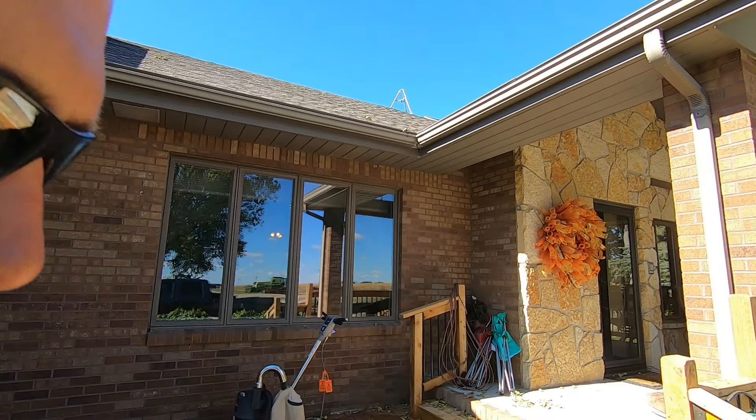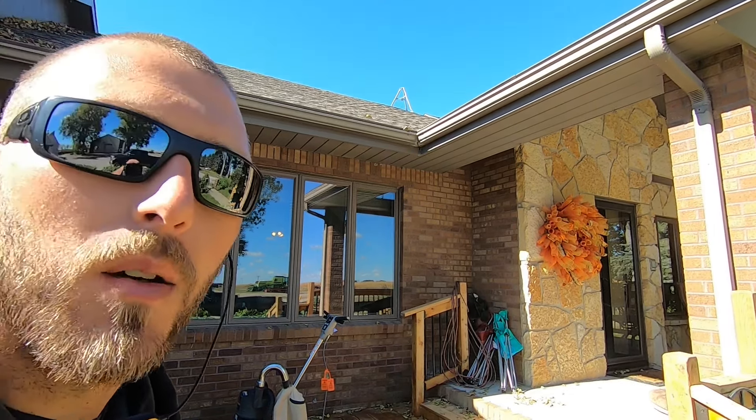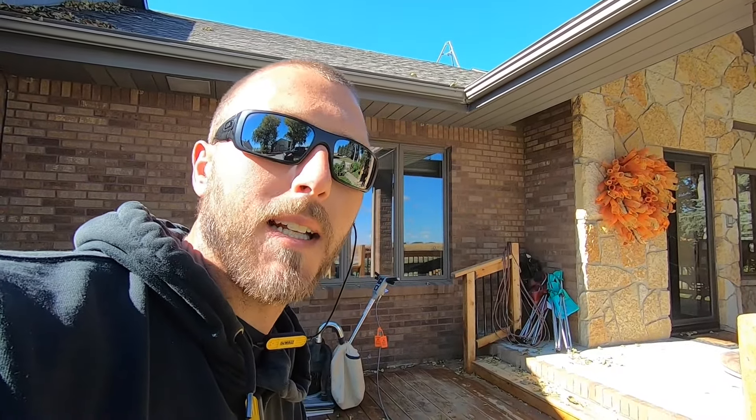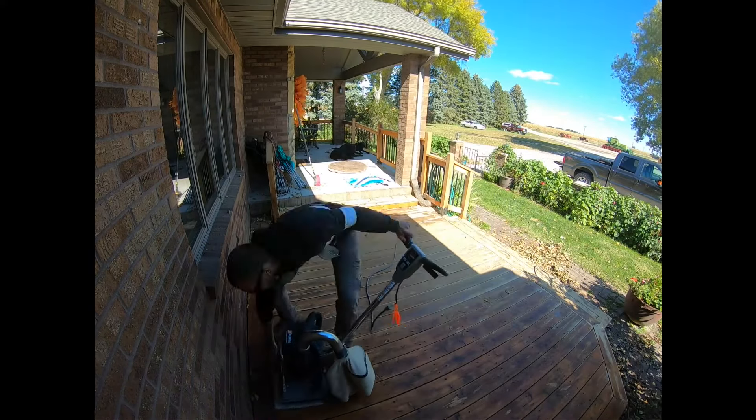Looks like this is going to work great. I'm going to hit it with 60 grit quick and I've got to dry a few spots where the leaves were sitting — just hit it with a towel quick. I think I'm just going to work my way down, wheel it back, move over three deck boards and go down that way. I don't have to worry about turning it around and really digging in. I hope this helps somebody — thanks for watching. Please hit like, hit subscribe and keep hammering.